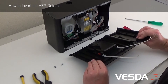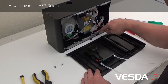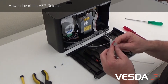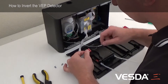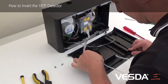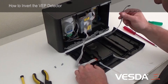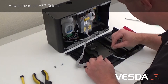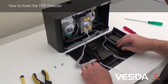Now all I've got to do is reattach our tethers, which is now onto the top — which is actually now the bottom — and plug our cables back in. The cables can only go in one way; there's a pin protruding from the cable and a hole in the board, it can't go any other way. Just take your time, don't force it. Plug the cable back in, and then your other cable from the main board goes over here — there's a slot on it so it can only go in one way as well.